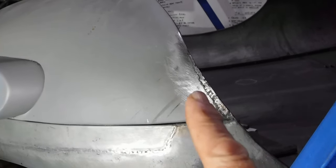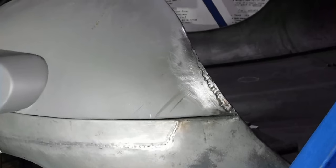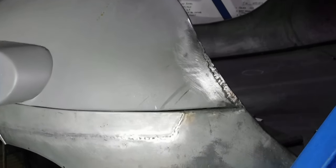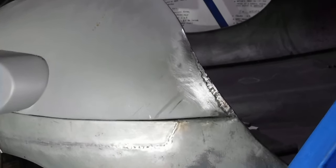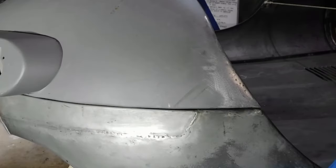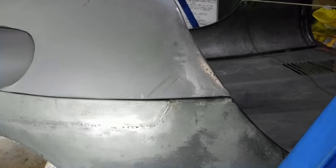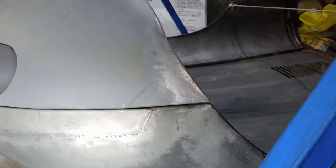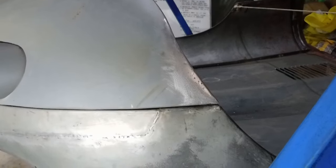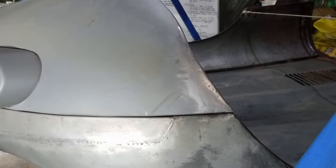In doing that I'd rather take the panel off. At the moment it's bolted on. So what I'm going to do now is go onto the other side and do the same. When I've got that into a similar shape, I'll take the panel off and do some fine adjustments. It's taken a while but I've managed to complete the filing of the new edge. It lines up nicely and provides a nice leading curve to the bottom panel. So that's now finished.